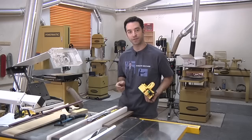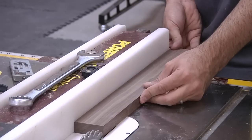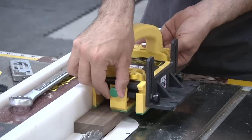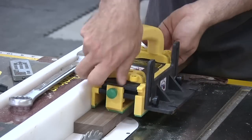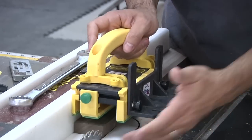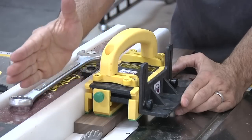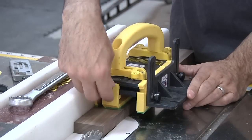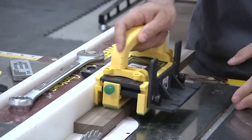Now let's get the Gripper set up to make a few test cuts at the table saw. I'm going to take this skinny piece of walnut and take about an eighth of an inch off the edge using the Gripper to push it through. The first thing I like to set is the adjustable foot — I want the large foot resting on the work piece to get the benefit of all that extra surface area. So I'll push it over to the right, clearing the blade, fully on the work piece but not in the path of the blade. Since we're pushing this into the fence as we go, even if I'm just slightly clearing the blade it will usually make it through without any contact. Once safely in the clear, I can tighten it down.